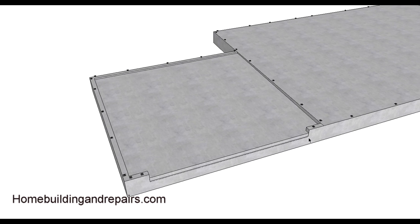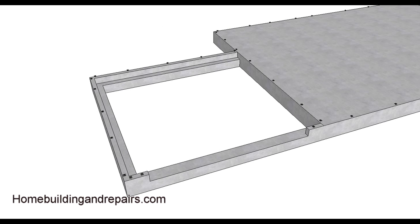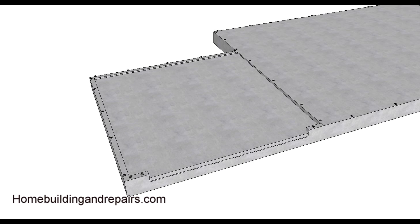Going back to the garage slab — you can see where it's a little lower. It's usually sloping; I believe an eighth of an inch per foot is the minimum on an interior garage so that water can drain out. Usually the foundation is poured with stem walls first, and then the garage slab is poured separately.